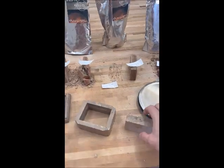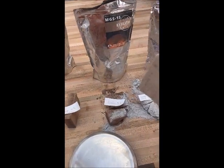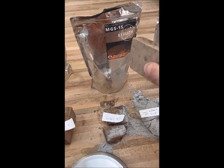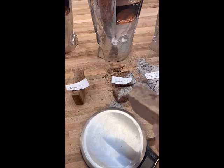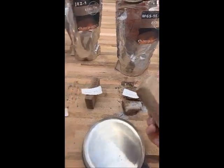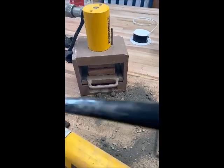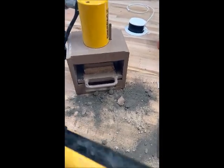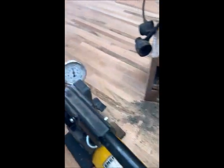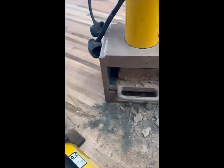This one's more of a wild card. I took about seven parts of the Mars clay and three parts of the sulfate-based soil that really didn't do that well on its own, thinking maybe I could temper the clay with some of the graininess in that soil. So we're just playing with house money on some of this Mars soil — we found two really good ones so far if not three. Over 3,000 PSI again on the gauge. This is really good stuff — that's more like 1,200 PSI in real terms. Another great Mars block.